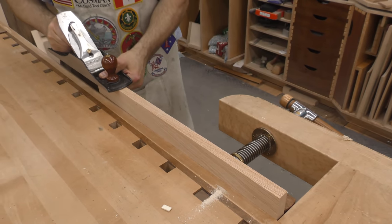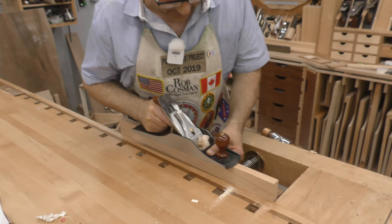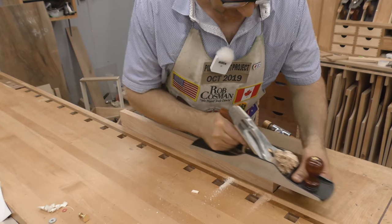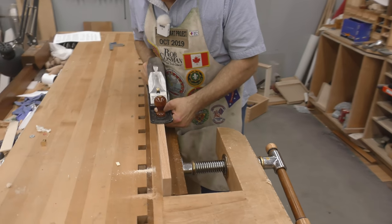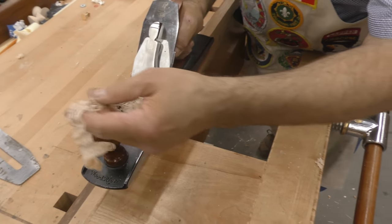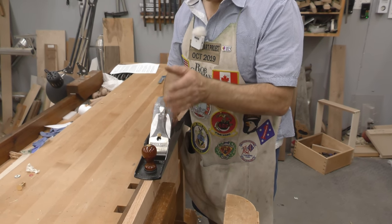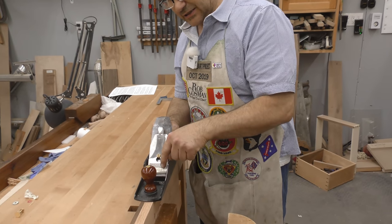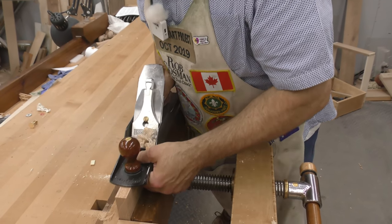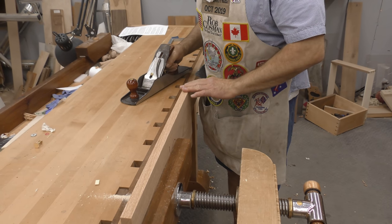Not a lot of arm movement — I've got to reach out a little bit at the end. Always make sure your blade is starting before the edge of the board. Careful not to allow the plane to dip at the end. I also pay attention to the shaving — with oak it's harder to read because of how coarse the wood is, not like maple or pine. But I want to avoid having that shaving veer off to the right or to the left, which typically tells me my blade is not set parallel. If it's going off to the right, I'm usually heavier on the left side. But I'm getting wood all along that pass, so I now know that surface is hopefully on one plane, meaning finished surface front to back.